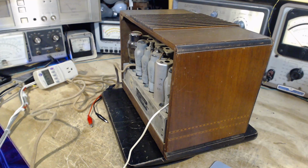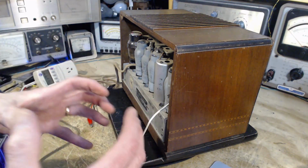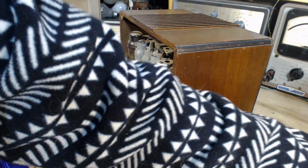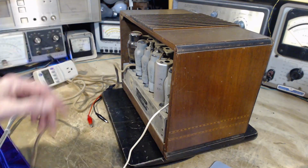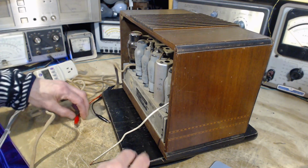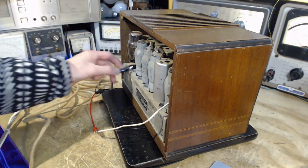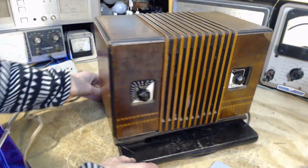What's happening is there's some kind of capacitive connection, probably the transformer itself. Its windings have a capacitive connection to the metal can, if you like. If I took a low impedance meter and tried to read this voltage, I might not see it. If I stuck a ground on here, it would be grounded away. So that tells me I shouldn't be too afraid of this next stage. Next step is back on the antenna, ground this. Look away. This might just improve the efficiency of the antenna.